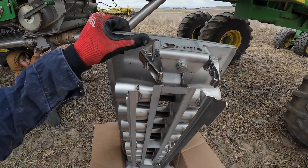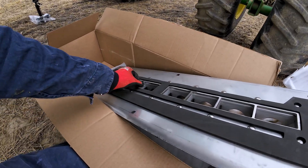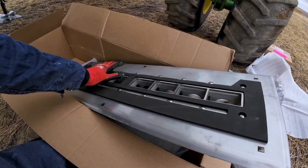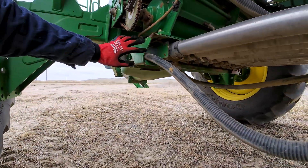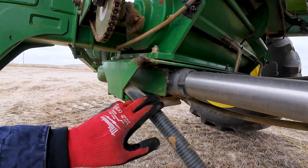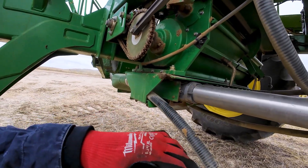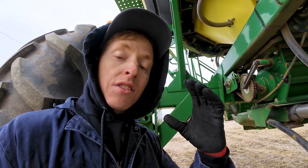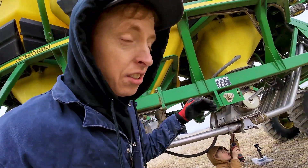It's a very clean design, all sealed up — simple, really low-cost solution. At the time of this video, I believe we're at $1,800 on this whole lower setup, and that includes everything you see here. That's going to change out all of this stuff — the plastic manifolds, caps, all that stuff — to a much simpler design. There are fewer leak points; it's just way better. And we're able to maintain the venturi restriction that helps draw product from your tank or bin into the airstream.